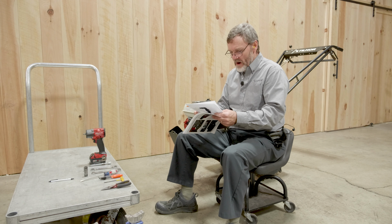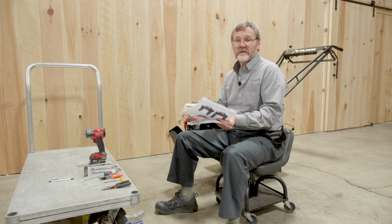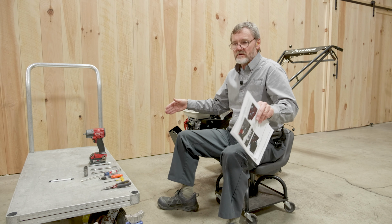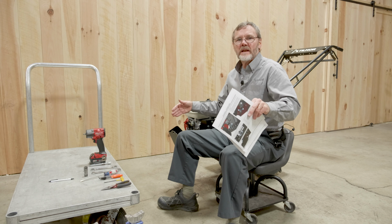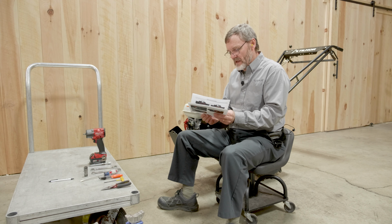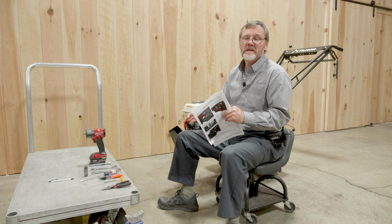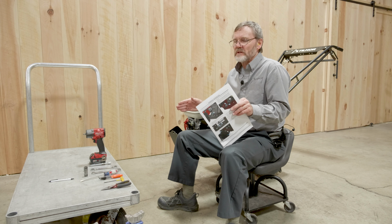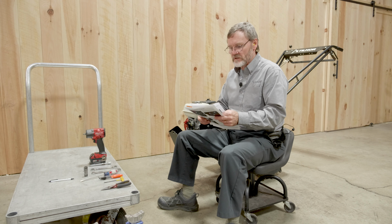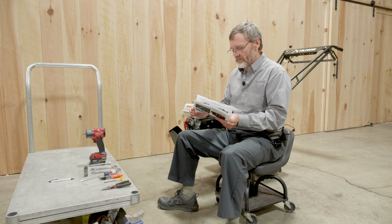If you went to the wide setting, for example, you would be able to straddle two 12-inch rows. So you could straddle two rows and still work outside of that, but that would center up your wheels to where they need to be. And then if you went to the mid-range, you could straddle two 10-inch rows, and that would approximately put the middle of the tires between the rows. So that's the reason for allowing for that adjustment.